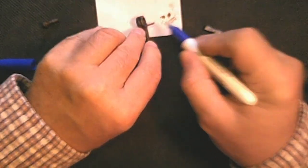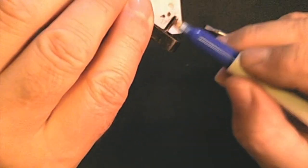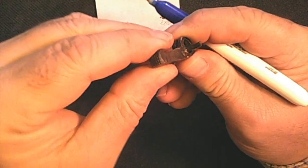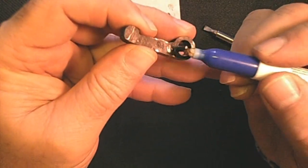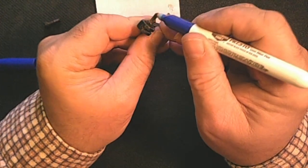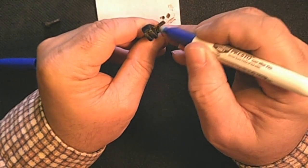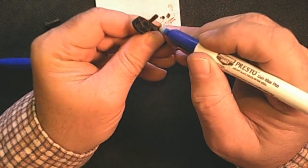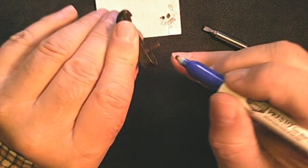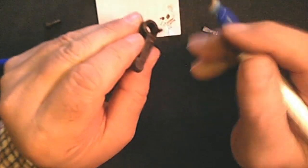Yeah, this one's working a lot better. You can see it bluing right up here. Now this particular pen, you do have to stop the action by rinsing it with water. But we'll just use this. And basically, I'm just doing this for rust protection. Though to be honest with you, the gun is in pretty bad shape as far as surface rust is concerned. And this is an internal part, so no big deal. But you can see here, we'll blue this up and get it working right.